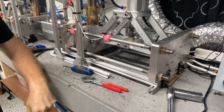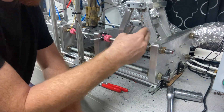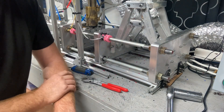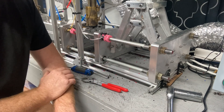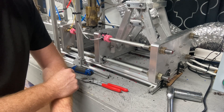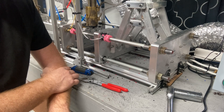Now she's coming down nice and level. That is just about perfect, so that gives me all the force I need for that particular mold and all the other ones. Just a little bit of resistance — you can see this plate will actually start to bow out and the rods are getting stretched, but I don't have any issues with flashing; it works pretty good. Next video will probably be making a mold since I have to make that three-eighths. Stay tuned if you guys want to see how I go through my entire process of making a mold — it usually takes me about a day, maybe two days. I'll try to document that entire process. Thanks guys.